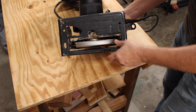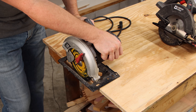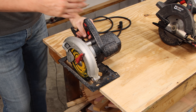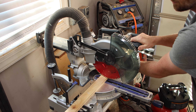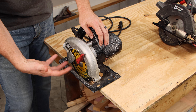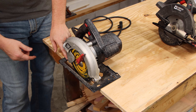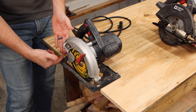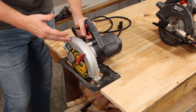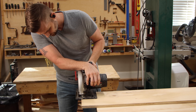There's also discussion about using your left hand and reaching your right arm over to hold the front grip. You can see the blade, but you're leaning over and putting your arm across the blade. In woodworking, it's good practice to never cross your arm over the path of a blade — whether it's a miter saw or a table saw. The saw has both a primary stationary guard and a secondary spring-loaded guard that covers the blade and provides protection above the saw where your arm would be.